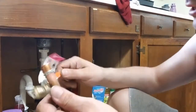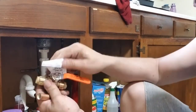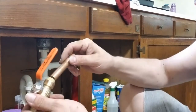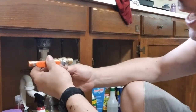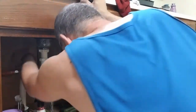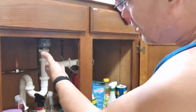We got this all capped off. This is like a backup system because I don't want that thing to leak at all. I soldered that on and now I sanded this end. This is called a SharkBite — you don't need any soldering for it. One thing about a valve: when it's inline it's open, if you turn it off it stops the flow of water. With this fitting, no soldering involved — you just push it in and it's sealed. It will not leak, won't come off. So I just have to push it onto that valve, then I can turn it off and turn the water back on and it'll be totally finished. You can actually take those off and reuse them too.